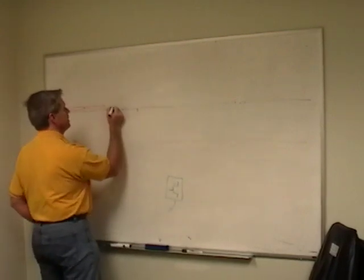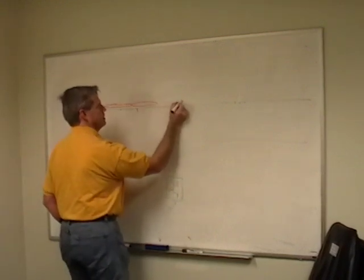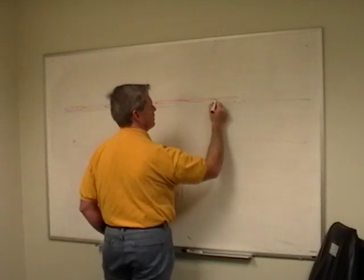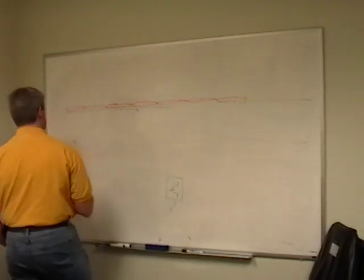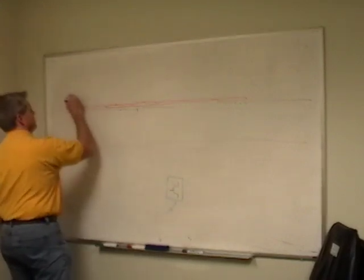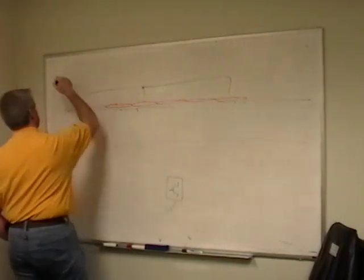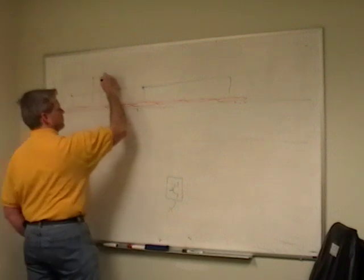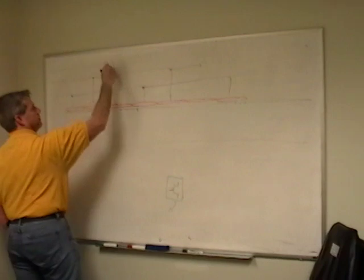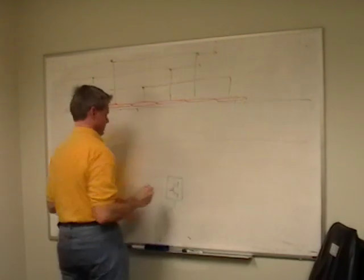So let's do this. We'll make a three-phase CCD. And we'll make our polysilicon run right up into each other without actually touching. And we'll do a connection again. This guy, 1, 2, 3. 1, 2, 3. This guy, 2, 3. 2, 3. This guy comes in. And so on.